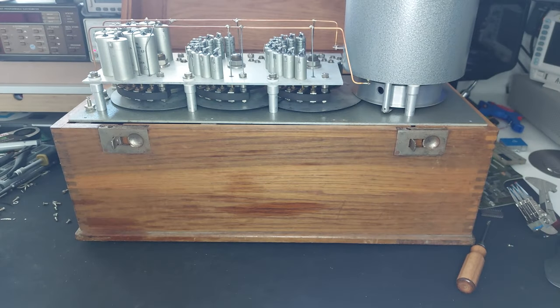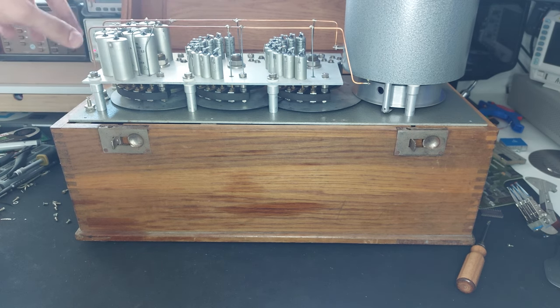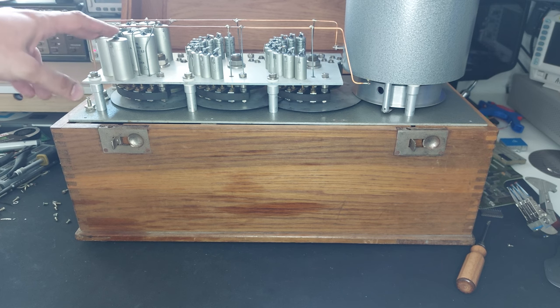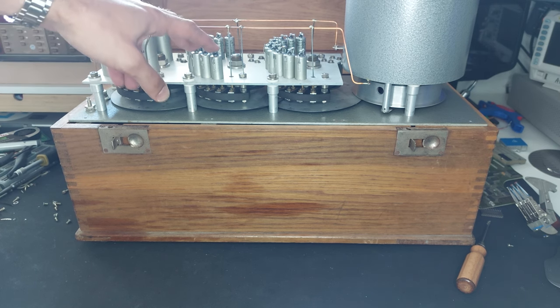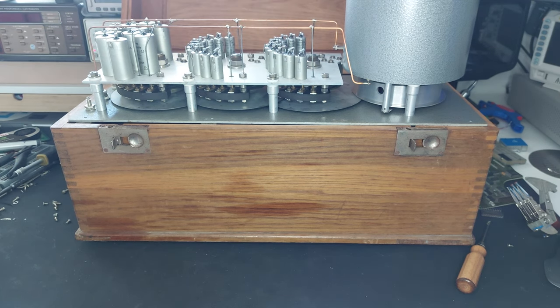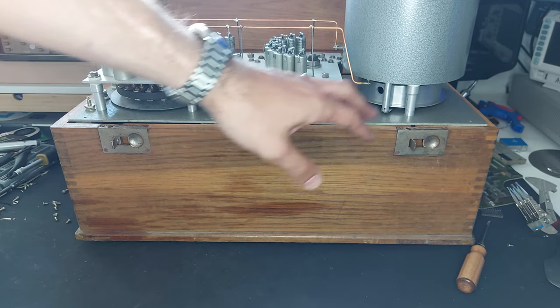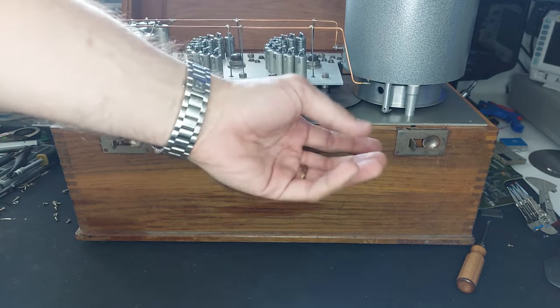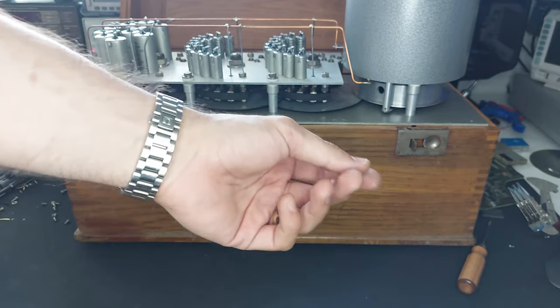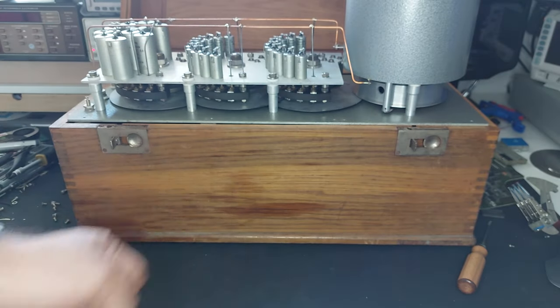Okay, go. Right, so what do we have here? We have several banks of 10 capacitors. These are 1 microfarad, 0.1 microfarad. These are 10 nanofarad, and these are 1 nanofarad capacitors. And this is a variable capacitor, this can here. Inside there is a mechanism, which is basically like one of those multi-turn potentiometers, but it's actually got a gearing of some description.